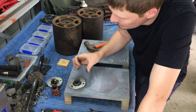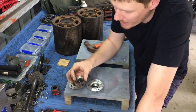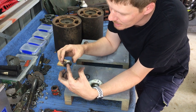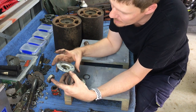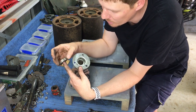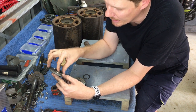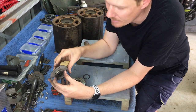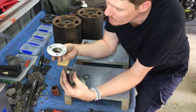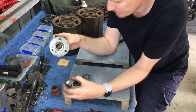I also noted this one here. So this one actually has a fair amount of glue, or bearing compound probably. And that was basically glued that bearing in place there. So obviously that bearing doesn't quite fit into the housing properly, and someone's gone ahead and glued that in there themselves. So hopefully that doesn't cause us issues down the track, though I'm suspecting it will.